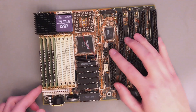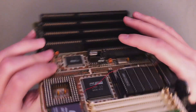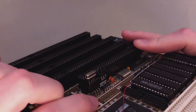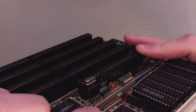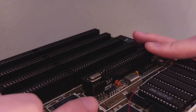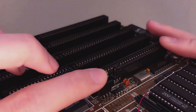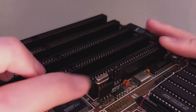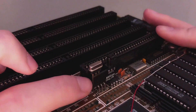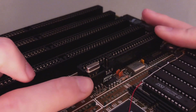Then I went here and I now have a permanent clock mode. So if you see here, I have completely removed the resistors and jumper and placed my own PCB. It is the same circuit I used on my previous videos, so it's just that now it's a permanent solution. This is quite good because it doesn't move and I gained a little bit of stability by doing this. This little device will be available for you to buy soon and I will come back with another video.